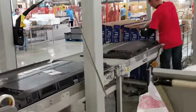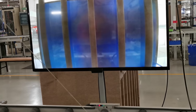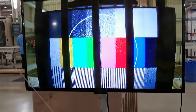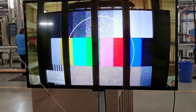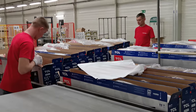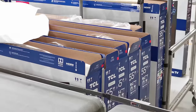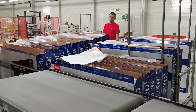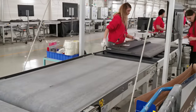After all this, the TV is going to be put in the box. There is another test here — audio test and tuner, testing RF and tuner. The tuner performs well, analog signal passed the test. Here is the final packaging of the television. After the final test of RF and tuner, the televisions come here and go back into the box that came from China — the panel comes from China in the box, and after checking and full assembly, everything goes back into the box.